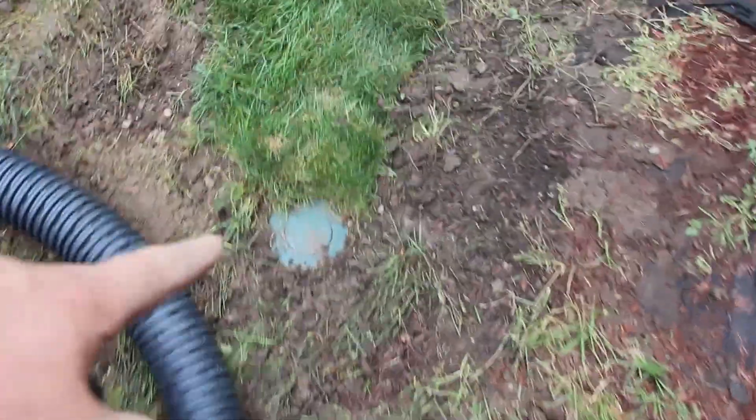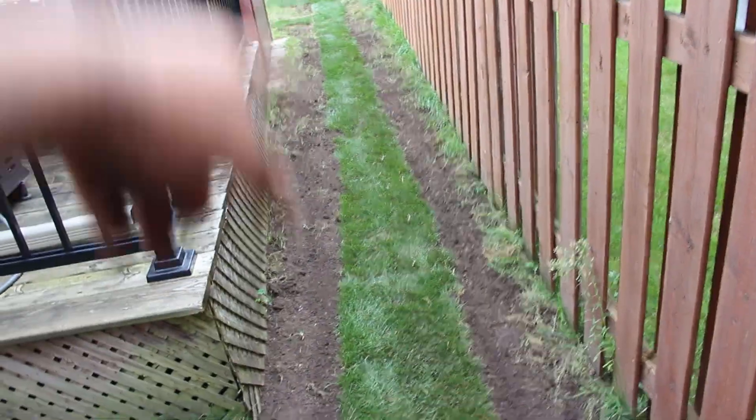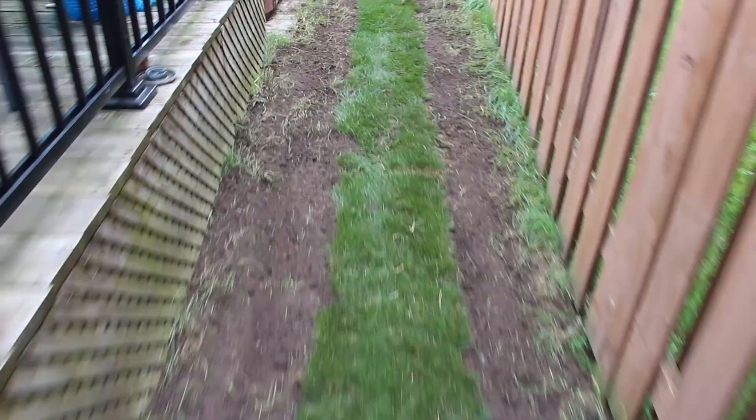Here we are. We got our pop-up emitter at the end where our slope goes down, and we've got our tie-in from our downspout — solid pipe through there to a tee, to our perforated pipe, which also goes all the way back. Got to do some cleaning up and seed a little bit around the edges. But ideally, by the end of this, you wouldn't even know we were here.